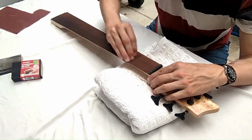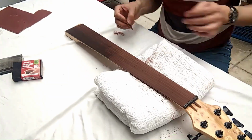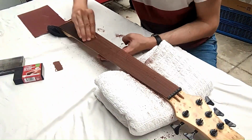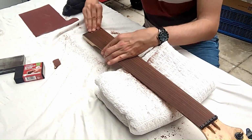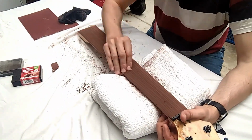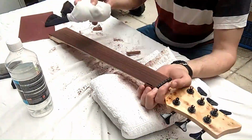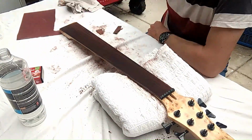First, you need to base sand the fingerboard, and don't be shy. I use a coarse sanding paper and really apply some pressure. This does 3 things. It evens out the surface if you already have string grooves in it. Second, it removes waxing or finish on the fingerboard, which the epoxy will have trouble sticking to. And third, it creates a rough surface which the epoxy can sink its teeth in. I learned this the hard way with lots of epoxy sanding. Make sure you get every corner. These can become problem areas. I use water-based turps for cleaning and wet sanding.